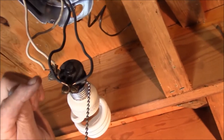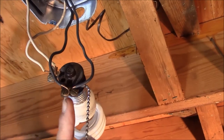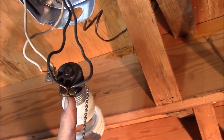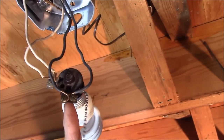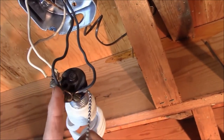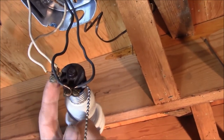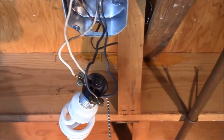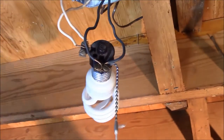These screws are silver or white metal, so white metal to white wires. These screws are brass - black to brass. So the black wire comes in, the two screws are acting as a jumper and the black wire can go somewhere else in this house. Same thing with the white. So you don't put two different colors under one screw in a typical pull chain operation - it's white to white, black to brass.